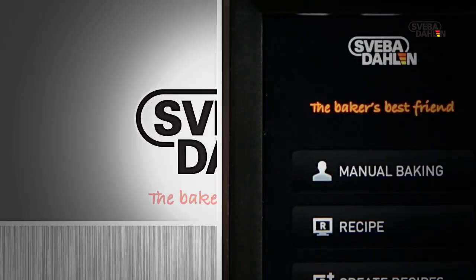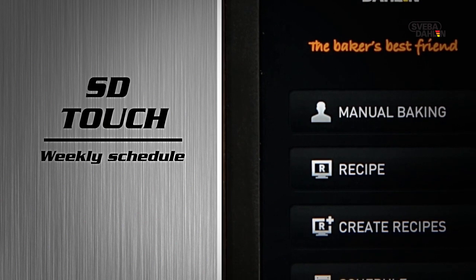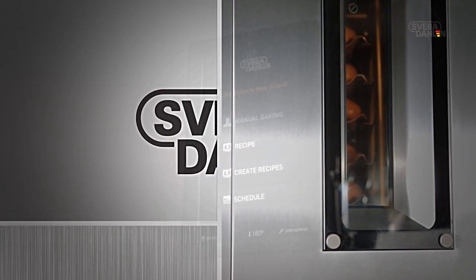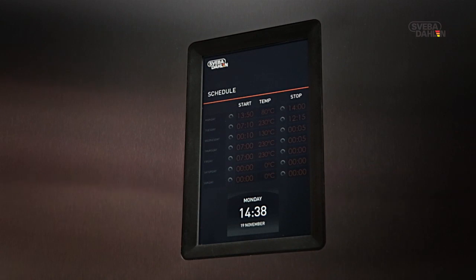When using the weekly schedule function on the SD Touch, you're able to optimize your work and at the same time make sure that your oven isn't running unnecessarily. Come along and we'll show you how. From the Start menu, press Schedule. Here, you're able to view all 7 days of the week. For every day, there's a start time, a temperature, and a stop time.